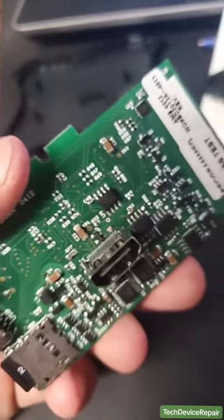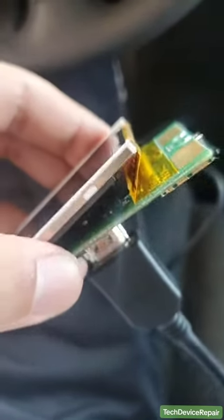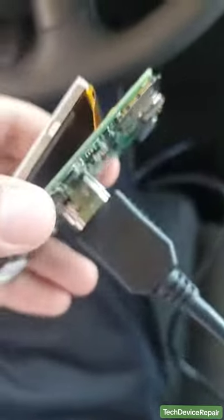Strangely, I removed the LCD and tested it again and the ground is good. In the car it worked for just a second and then it died. That tells me there's a hairy chip here. I'm going to redo the HDMI port and check some more.